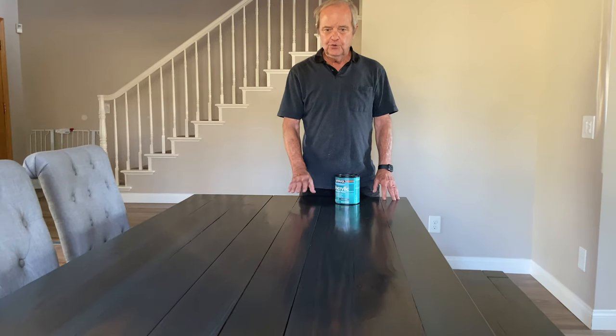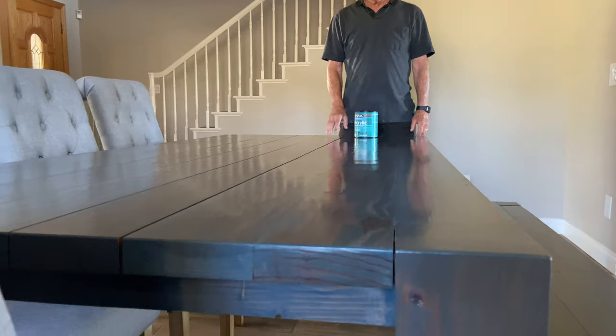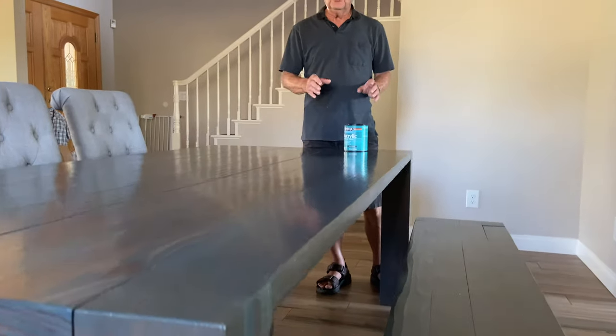Here's an example where you could use polycrylic or lacquer. This is a farmhouse table that we built — it turned out very nicely. We didn't use expensive wood and we used a water-based stain on this. If you bought this from a commercial manufacturer, they would not use polycrylic. They would use lacquer with expensive spraying equipment, because it is lightning fast to apply multiple coats of lacquer onto a piece like this. A lot of commercial furniture is spray-on lacquer. However, we did not want the smell or the toxic fumes, but we still wanted a durable finish. And by the way, polycrylic is more durable than lacquer.